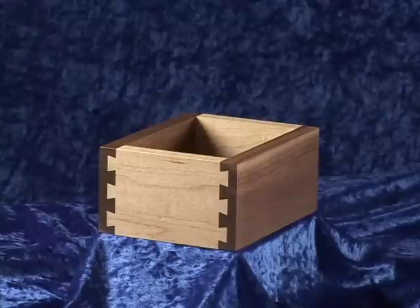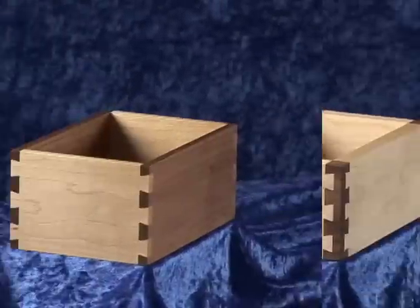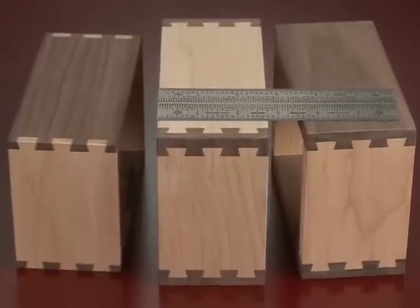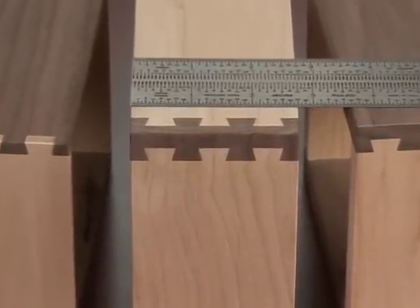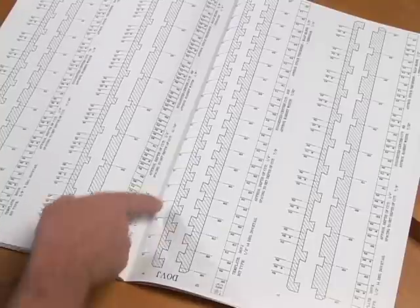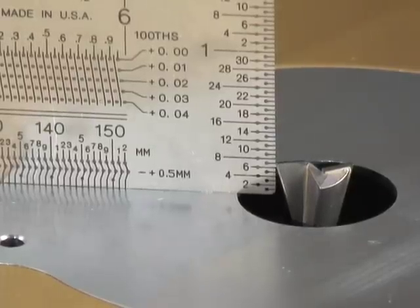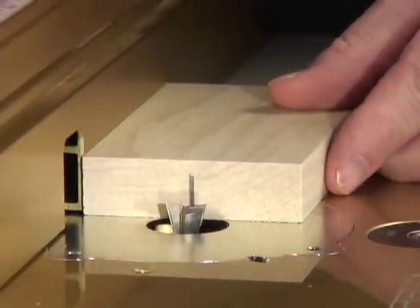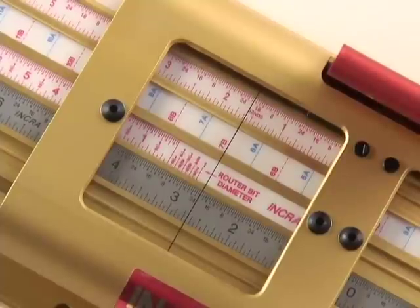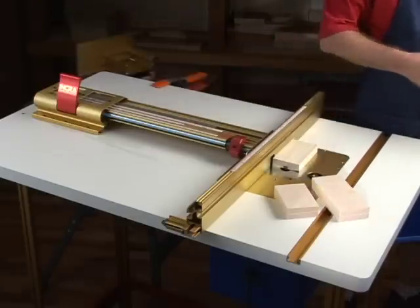In the three joinery techniques to follow, half-blind dovetails, corner post dovetails, and through dovetails, all of the examples shown reflect stock preparation and centering based on 2¾-inch wide material using the Dove J pattern. If you set your depth of cut for a 1/2-inch 14-degree dovetail bit, center your LS for 2¾-inch wide material using 7B on the template for your center cut. Then prepare your stock accordingly for each joint type.